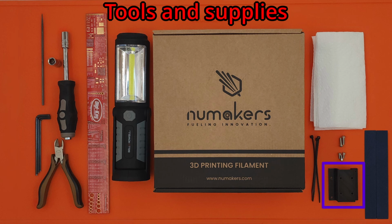A 3D printed cable mount will be required for holding up the printer's main cable. There are many different options you can use, but in this video, we'll be installing the cable mount that I designed, link in the description, which uses three M3 by 6 millimeter socket head screws.